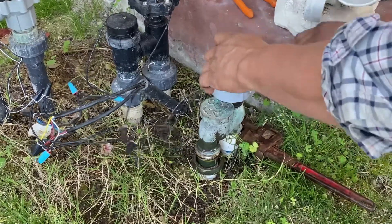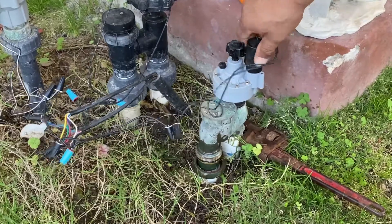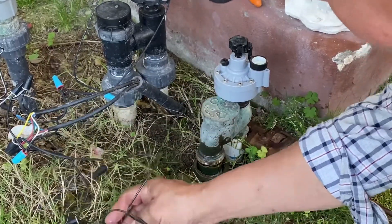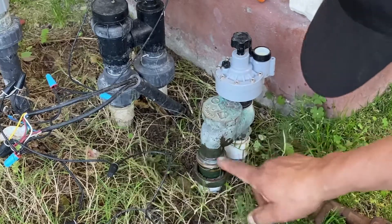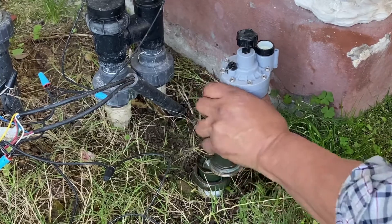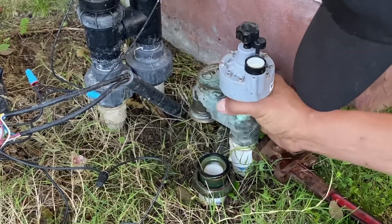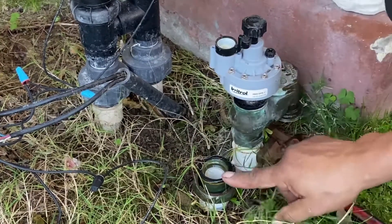This right here, you can just twist this off right here and deal with it later. I will have to change this also because the new valve comes with the solenoid. I got it off right here. You wanna pull this right here. It's a lot easier to take off — break a valve off when it's connected to PVC versus this guy right here.